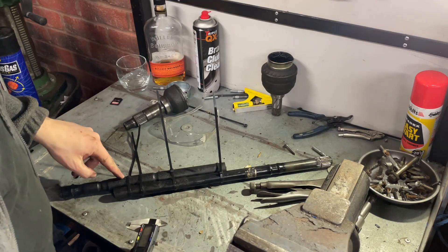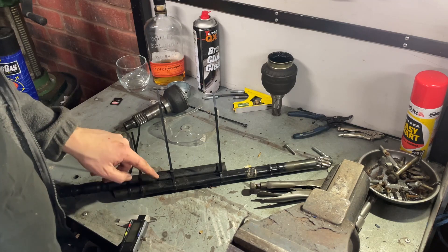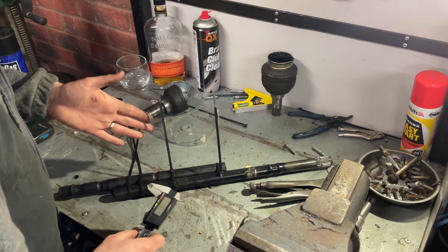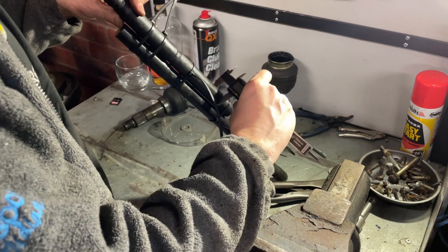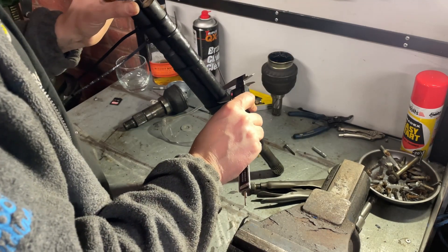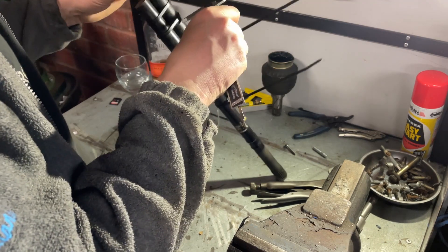So what we need to do now is find the point where the diameters are most alike between the two shafts — because you can see they step down and step up — so that'll make it easiest to weld them together if the diameters are the same. 35.2mm. Once you've found the closest diameters, mark it up and let's make sparks.